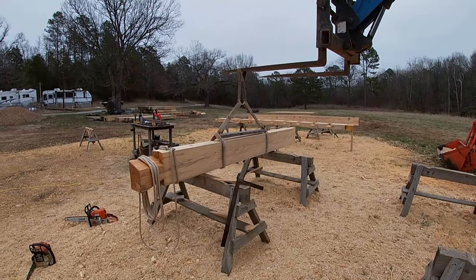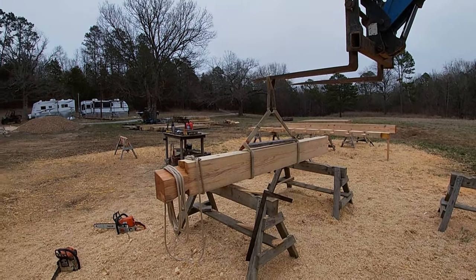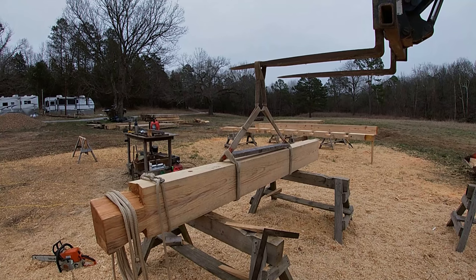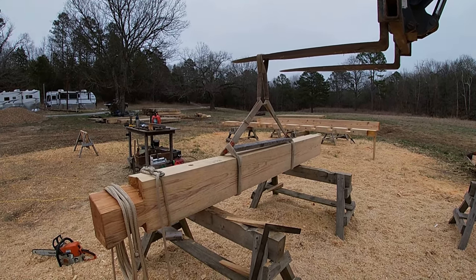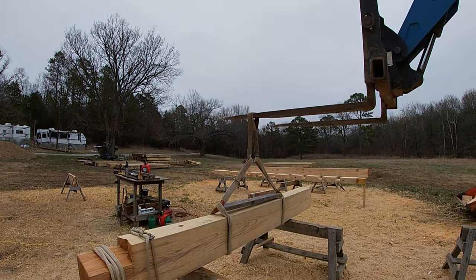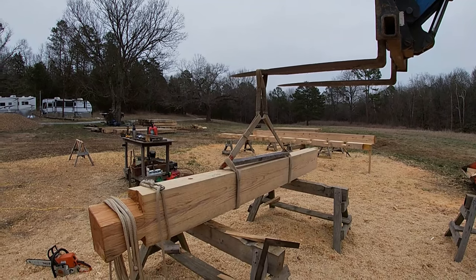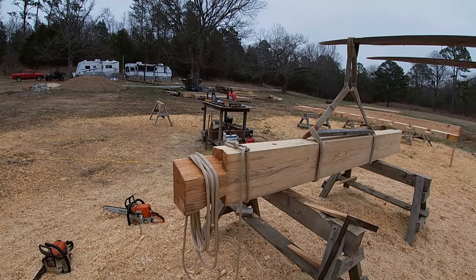We're starting in to set round 8. This is seawall CR round 8. We're doing a double strap. We've been able to get by with 3 people. We can get by with 1 strap, but from now on we'll be using 2 straps, and we're using a little bit of a spreader bar just made out of a 2x4 and hanging off the fork. That gives me some leeway to swing it with David on the machine. I think this will work pretty good. I have a guy rope on it to guide it. We'll see if we can get this up there and get it set.